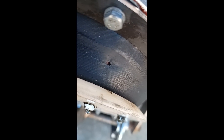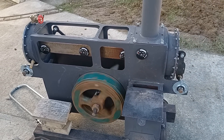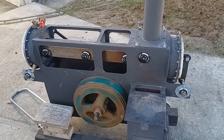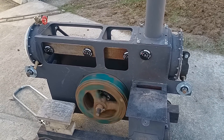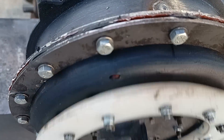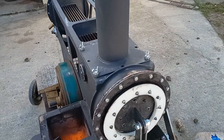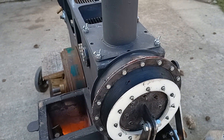It's managed about an hour and a half but now we've got the pinprick again, and in exactly the same place as the silicone seal. Even though it's got a hole in it, it'll still run so I'm going to keep it running as long as I can. When I take the hot side bits off again I'll have a better idea of what's wearing and I can evaluate the situation. Now we've got two holes and the leaks are just too much — it's stopping.